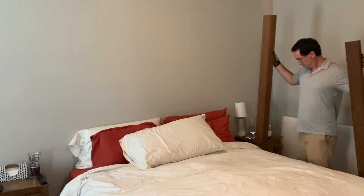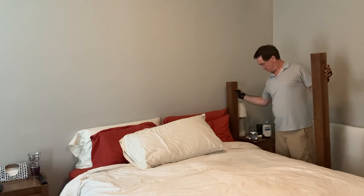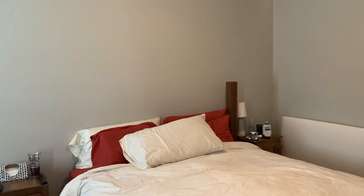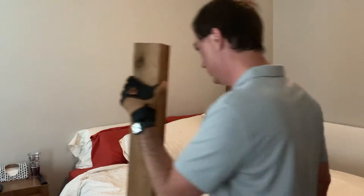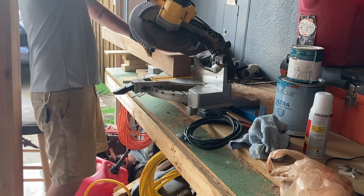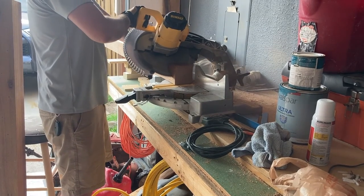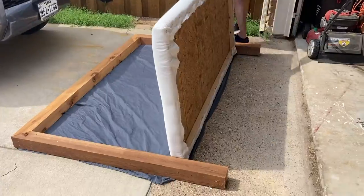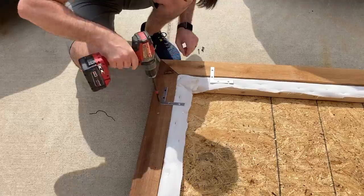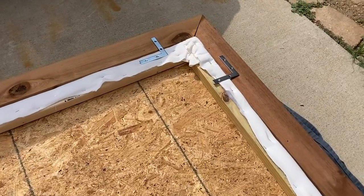At this point, Matt and I were clearly in the home stretch and so excited. We took the two 4x4 posts from our previous queen size headboard and brought them in just to test everything out, because whenever we got ready to cut the last two 4x4 posts, we really needed them to be right the first time because cedar is really expensive right now. Once Matt felt confident in the 45-degree angle cuts he needed to make, we went outside to the garage, knocked those out, and then started securing the whole headboard together using L brackets to secure it to the 4x4 posts — they worked like a charm.